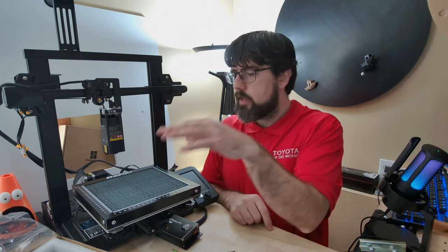Here's the machine all set up with the air assist installed. It's currently doing its framing on initial setup. I set it up and installed pins to hold the piece in place. This is an acrylic mirror with an adhesive back, so this is a material test — it will do 100 little squares at different speeds and settings. The air assist box has low, off, and high settings; it's fairly quiet with good airflow. For the test I'll have it on high. You push the button once to start framing, then once more to begin the actual test.